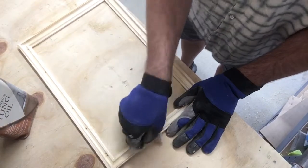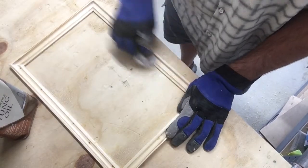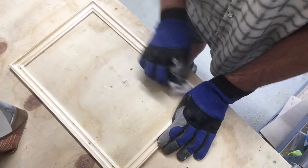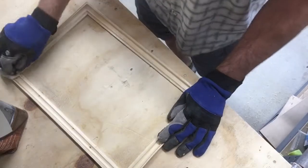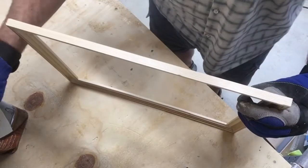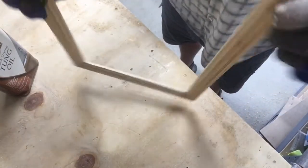For the treatment, I'm using some quick-drying tung oil. Once you place it down, you'll wipe off the excess in about 20 minutes. Then let it dry for a few hours and re-treat it again. Just make sure to get all the sides as well, although it would still soak through and get them for you.